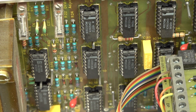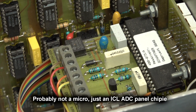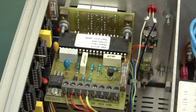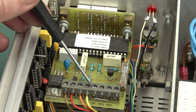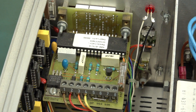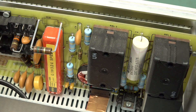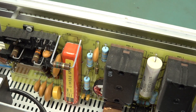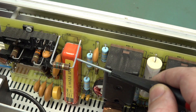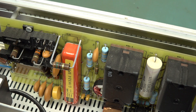What's interesting is it's all 4000-series logic — none of this TTL rubbish. The only microcontroller is for the display panel board, where they've rolled their own display panel with its own little trimmer for calibration. It's probably used across several different Schaffner designs. Over on the injection PCB, check out the lead length on that power resistor just flapping in the breeze. They've put an insulated sleeve over the leg there as well, and one component has a little alien crop circle coil — they just needed some extra inductance, I guess.